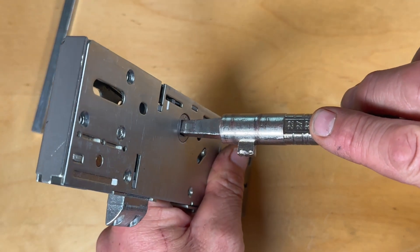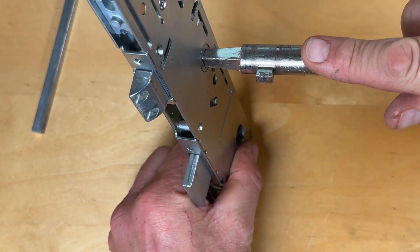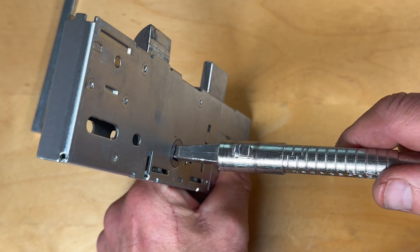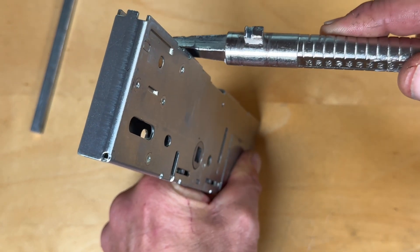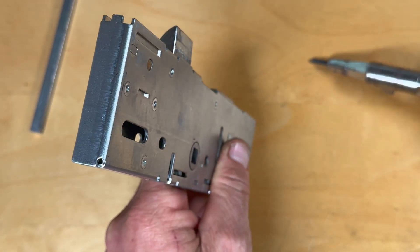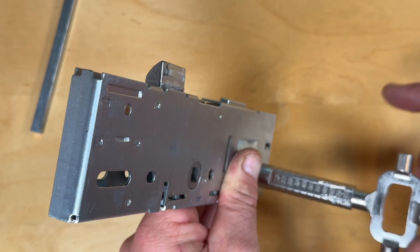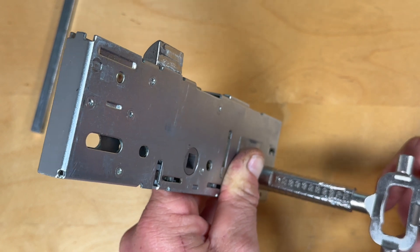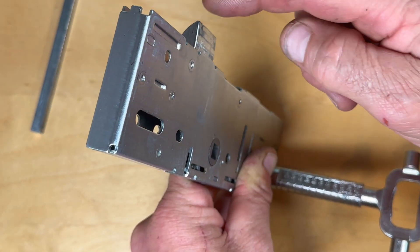On this one we can operate just one half, and that one half will retract the latch and deploy the entire multi-point lock mechanism. But the other half — effectively the exterior side — deploys the multi-point mechanism but does not operate the latch. This means that when the door is closed and the person has left the property, they're not actually going to be able to get in using the handle. What they're going to have to do is insert a key into the centre case, and the key is allowing us to operate the latch. So it's like an additional security feature — when the door is closed but not locked, you still need the key to get in from the outside, but you can still operate the latch from the inside.